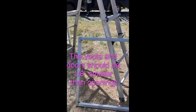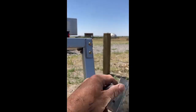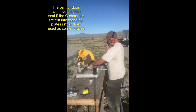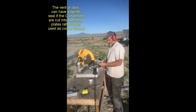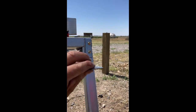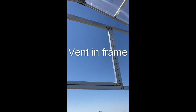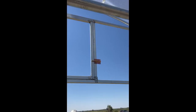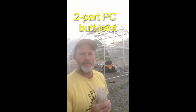I have pretty good wind direction here, but always make sure your vent openings are about an eighth inch shorter. You can use C channel to frame up your vents, but it leaves a bigger gap for air to blow through, so I find it easier just to use mending plates — in this case some C channels cut down. Harbor Freight has the best latches — you can get brass-finished latches there for $1.99.